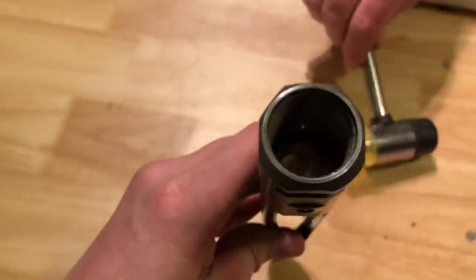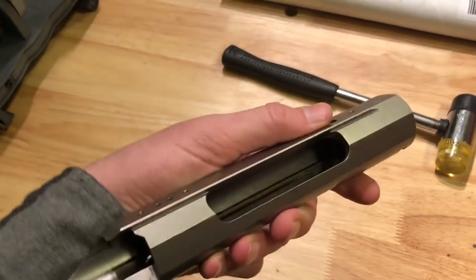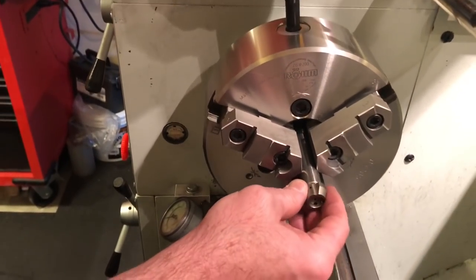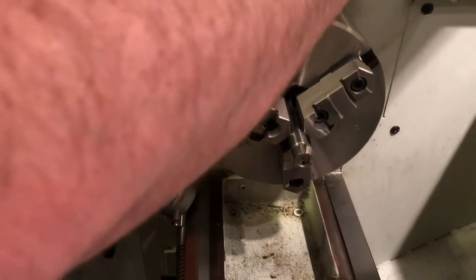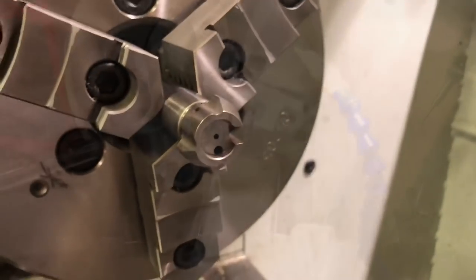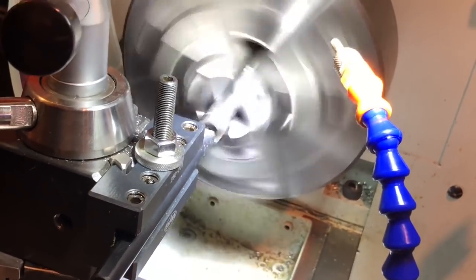Here's a quick look at the action. It's pretty stout — it's made of solid steel. Now here we're going to open up the bolt face of the bolt, because I went from a .243 to a 7WSM. We have to actually open up the bolt face to allow it to hold the larger cartridge head.